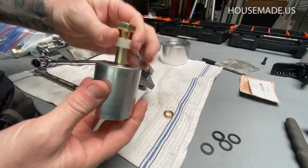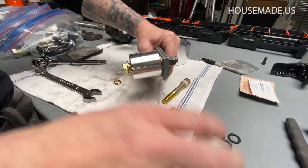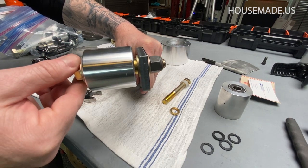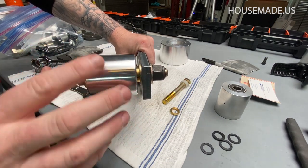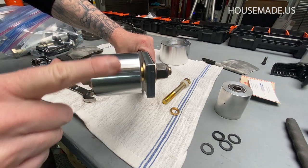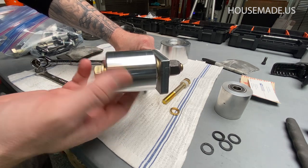What the spacer does is keep the whole thing from binding when you tighten it up. If you tighten it too much - like with a wrench - it would slow the wheel down and stop it from spinning freely. There's a little bit of play you need to balance out before mounting. Without this, you'll get a lot of bearing noise and friction, the belt won't spin freely, generating heat that will warp your belts and destroy your bearings over time - sometimes rather quickly.